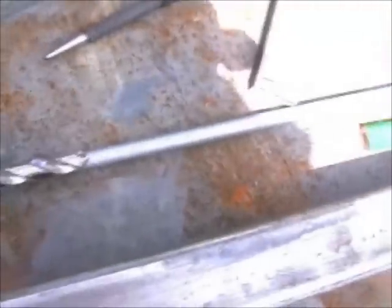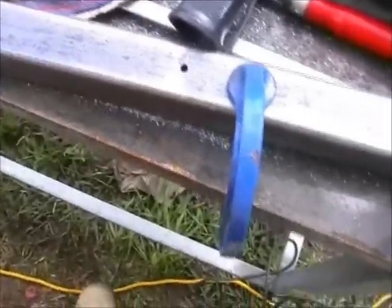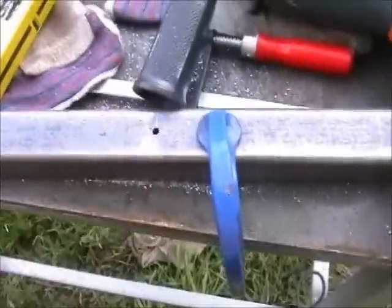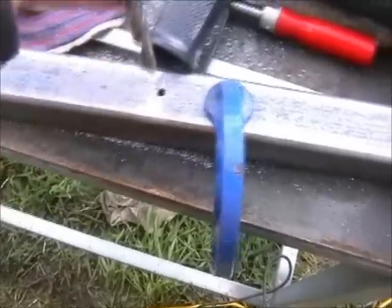This is the 10mm drill bit that will cut a hole for an M10 galvanised rod to go through. That's a bit big to start with though, so I started with a 5mm drill bit and cut a 5mm hole first, then I'll move on to 10mm and just hope I can keep them more or less in the centre. Obviously if you had a drill press you'd clamp it, use some lubricant, and get it pretty close. But I'll do it by eye with a hand drill and hope it doesn't steer too much.